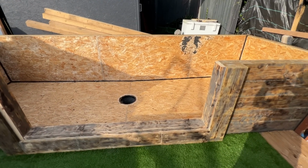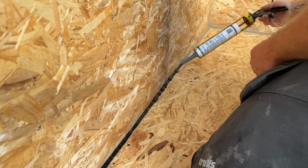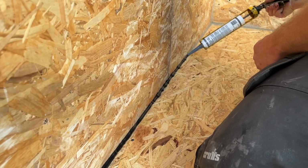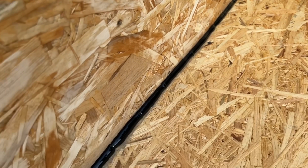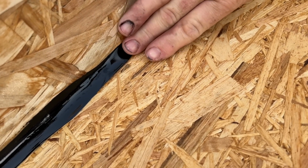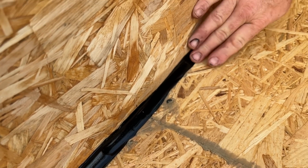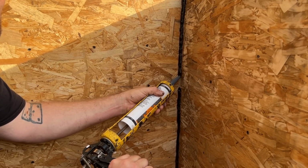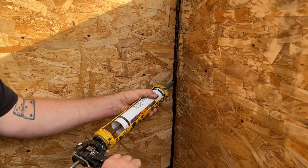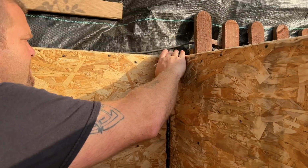So with the MS300 as well, we've gone all the way around the seal. I'll show you how we go through, silicone all across, wetting my finger, coming across, making it all nice and pushed in, so it's all in the corners. All the corners are done, from the top down to the bottom. Same in every corner, it's got a good fit beading, a good 10-12 mil, pushed right into the corners all around.